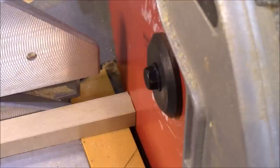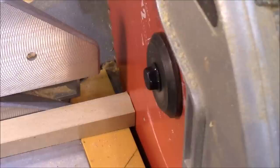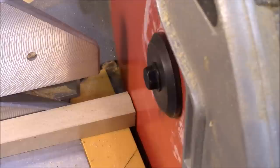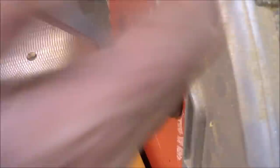Now let's run that test again. There's our X right up against it. So now our X is probably the closest point. And that's probably the farthest point, which our X is about right here. So it is not the blade, because it would have continued — every time the X came around, if it was the blade, the blade would have been the largest gap.